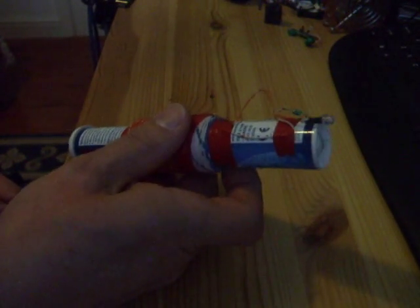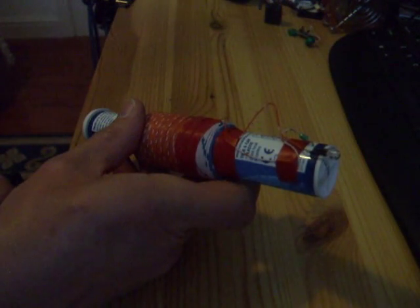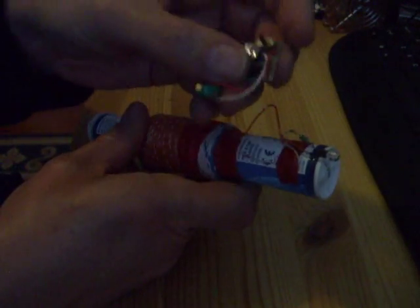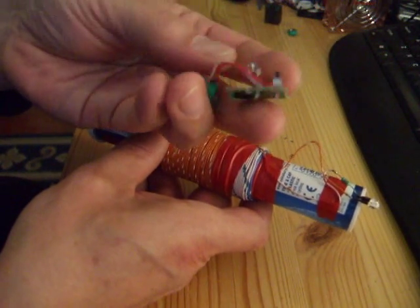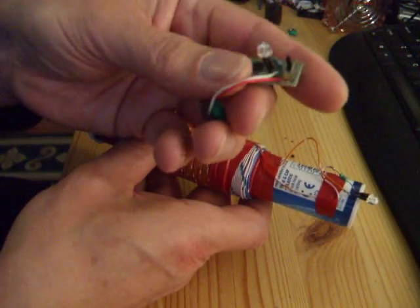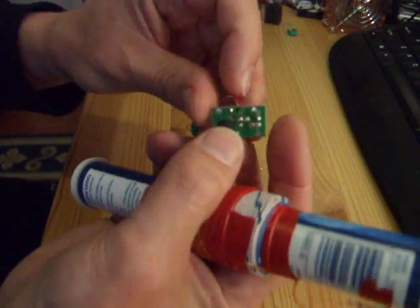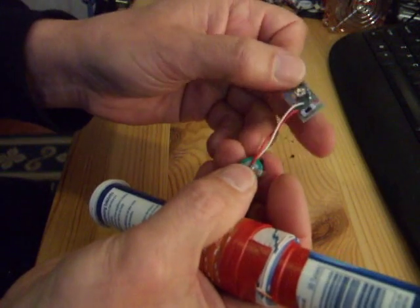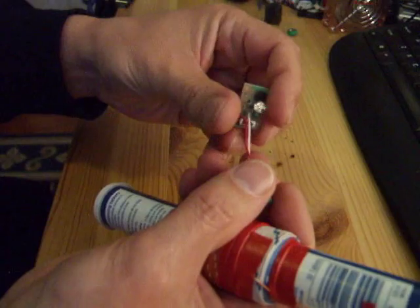I've had a little think about it and I'm going to try and get a little bit of circuitry in there to give me a slightly better light. I've got quite a few of these little circuit boards that come out of the garden lights — the solar powered lights. Normally the solar cell goes across the two contacts at the top here, charges up in the daylight, charges up this tiny little battery, and then lights up the LED.